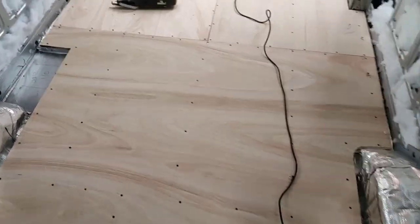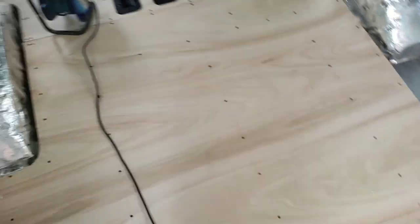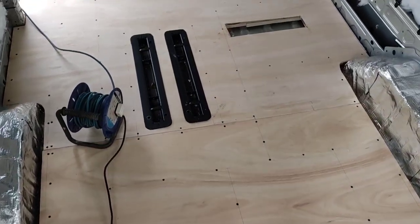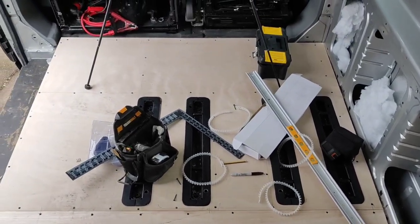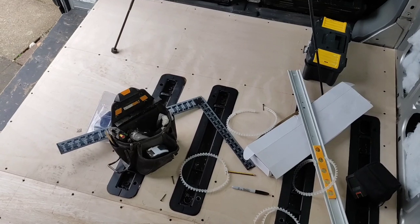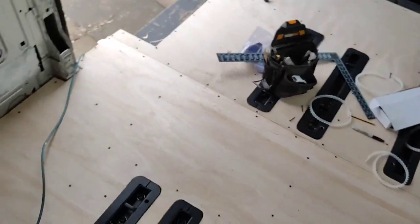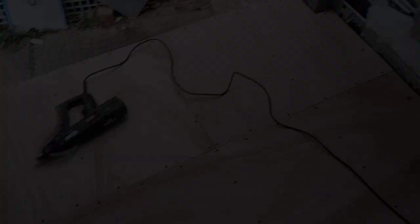That's the advantage of the auto-feeding screw gun — I've just put in about 220 screws in under 15 minutes. I just need to go around, there are a couple of misfeeds, and you can't do anything about that with the auto screw gun, so you still need a normal screwdriver just to go around and make sure everything is either flush or below the floor level. But that shouldn't take very long.